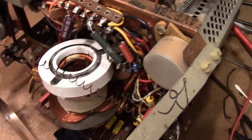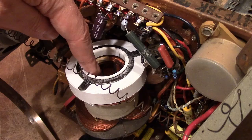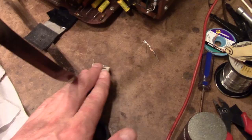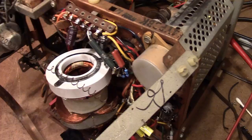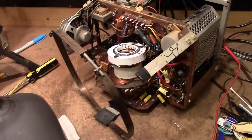As far as the yoke cover goes, I actually did not end up using heat to melt it. I realized when I put down this ring to hold the centering rings in place that the interior diameter was a little too small — there was an overhang. So I just used some 220-grit sandpaper and worked all around in there. It's now completely flush all the way around, nice and smooth, and it fits in there a whole lot better. So I'll scrape the coating back, put it all back together, and then resume troubleshooting if there's still any problem.